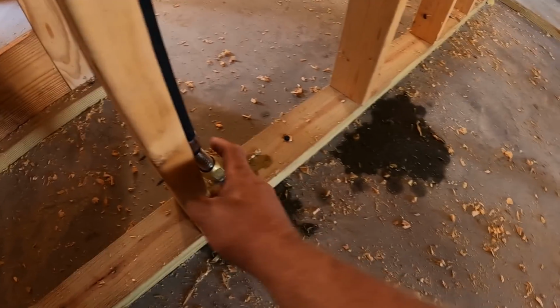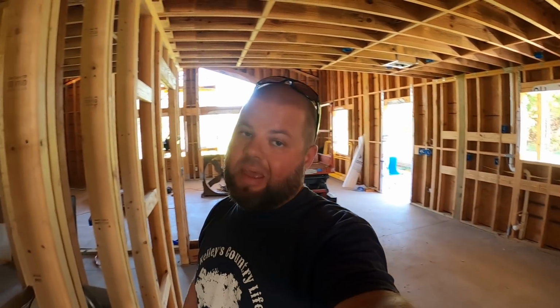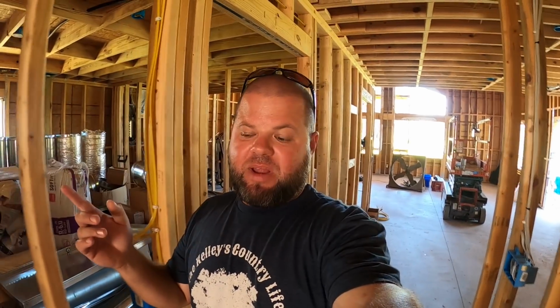We found no holes in the line, no failures in these type of crimp fittings, nothing. So that makes me feel good. That line is pressurized up to 30 PSI right now. That's above what it's even required to be at. I think you test them around 25, so we're close. But I think working pressure, because it's going to get stepped down at the tank, is 1 to 2 PSI. So we're night and day above what it'll operate at. So no leaks in the fittings, no leaks in the lines. It was just human error. We all make mistakes. So I felt so good about that.